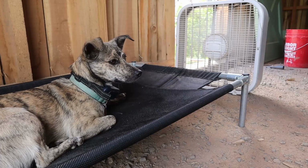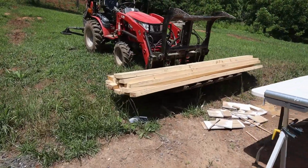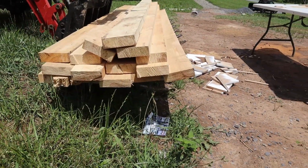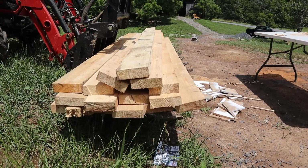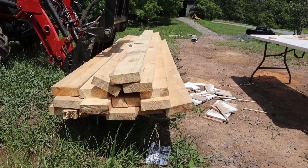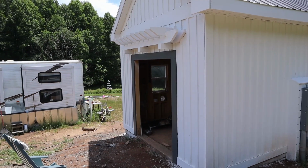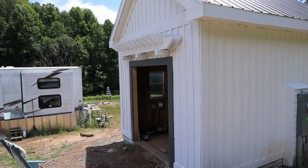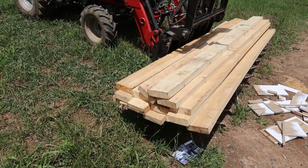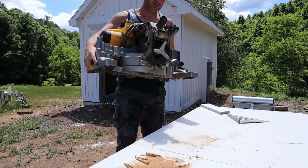So we're shooting for using 7 of these boards, these 2x6s, and I'm going to basically put one on the table saw, rip it down, make sure that edge is straight, and then flip it around and shoot for that 5 1/16. Then I'm going to cut them all for whatever height I'm dealing with here, so I have all the boards the same. Then I'll get out my surface planer, and I'll send every single one of these through individually, so that they're the same thickness.